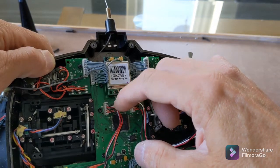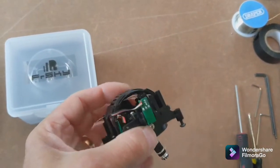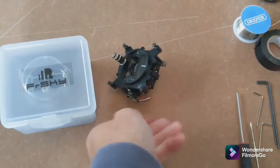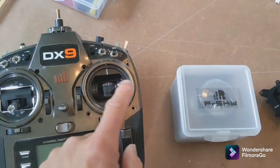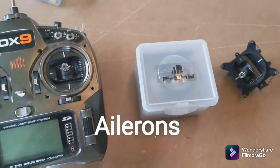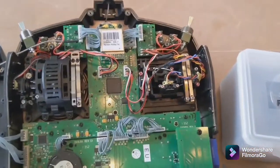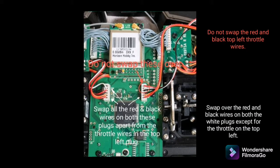Here's the old Spectrum gimbal, worn on the pots — you can see where I've cut the wires for the new ones. The next one is going in for rudder and elevator. At the back, the wiring is cut off and you reuse the original white Spectrum plug. The red and black from each of the two gimbals is reversed, apart from the throttle which is the right-hand plug, top three wires.